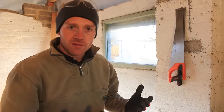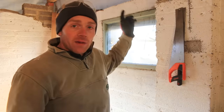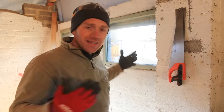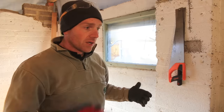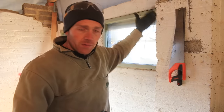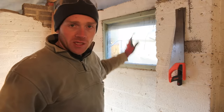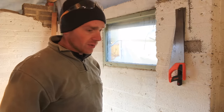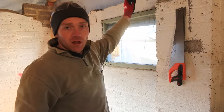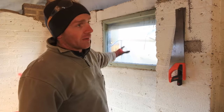I'm kind of doing things back to front - everything's back to front with this project. I can't get around to doing the brickwork or the windows in the next couple of weeks, but I need to get this insulation in. So what I'm going to do is get our stud walls put in - they'll have a breather membrane on the back, then I'll have all the insulation in, vapour barrier, plasterboard and all that stuff. I can then come in and do this brickwork afterwards, or have it done by a brickie, and sort out these openings.